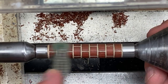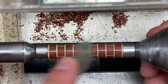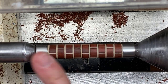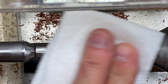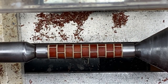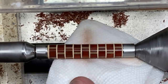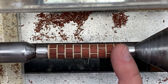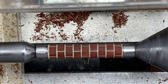I picked these up at Walmart — I get like five or six of them for about a dollar. They're really cheap; I use them all over the shop. I've removed as much of the dust as I can with the brush, and now I'm just going to use some denatured alcohol on a paper towel. That looks good. Let me start the lathe and we'll clean with the lathe moving. Looks pretty darn good. I should have probably put it on the non-stick bushings before I did this, but I'll clean it again right before I put a finish.